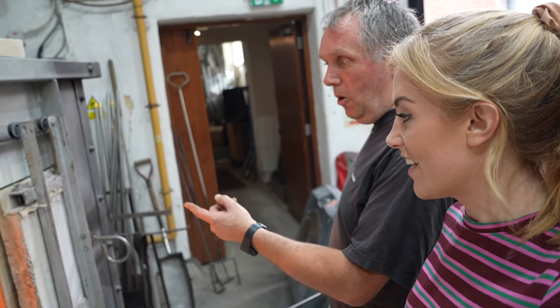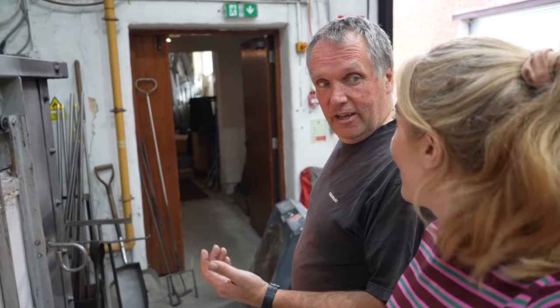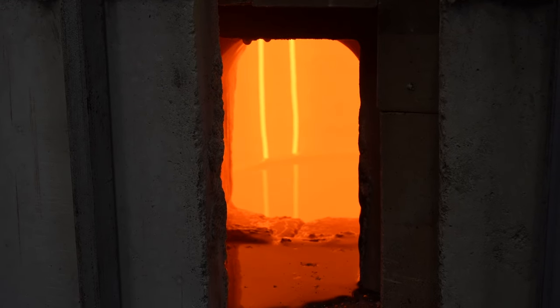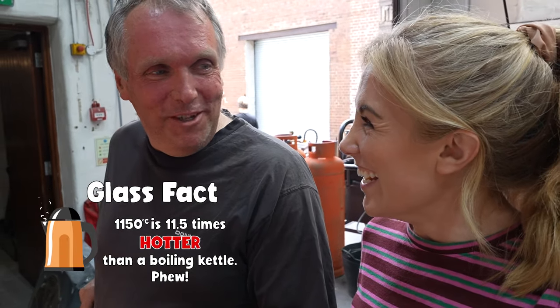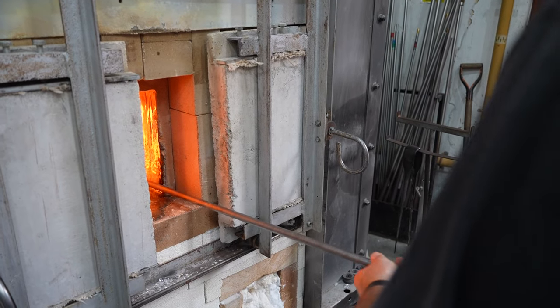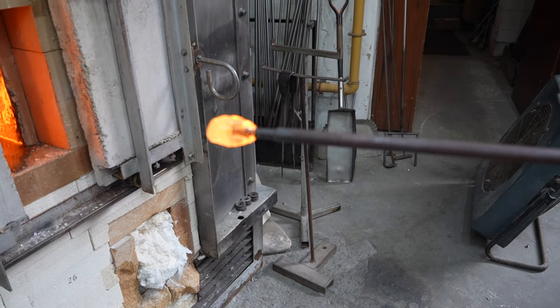In here there's a big pot with molten glass in it. It's like getting honey out of a jar with a spoon — just go in, give it a turn. Paul describes it as honey, which is fitting because it turns out I'm actually a beekeeper, so I'm used to working with honey, but not molten glass! This is very hot honey. We call it a furnace, and it is so hot I can feel the heat coming from it — it's at 1,150 degrees centigrade. Inside we have liquid molten glass, and all we're doing is putting the iron inside and dipping out a nice blob of that liquid glass.